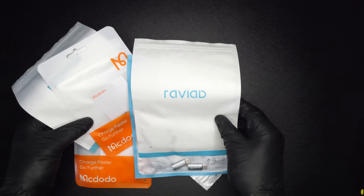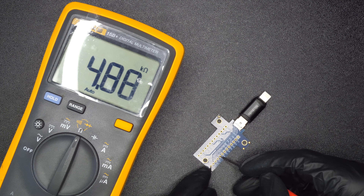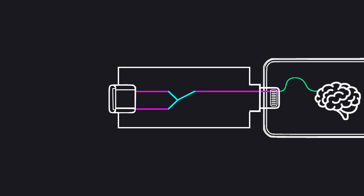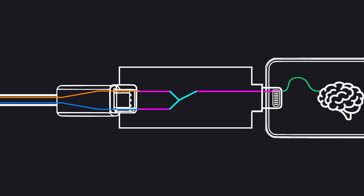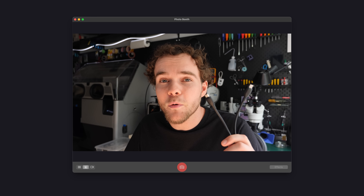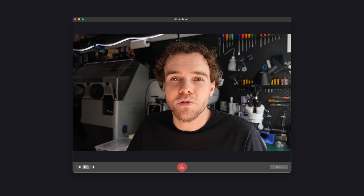I went on Amazon and bought every single one I could find. It's so sad because most of them still use the resistor trick, while some went even dumber in my opinion — they just connected the two CC pins together. That works with some cables, but other more expensive and faster cables actually have two CC wires inside, and with those it just won't ever work. That goes against the dream of USB-C. I want something that works with any cable. But I think I found a solution, so let me show it to you.